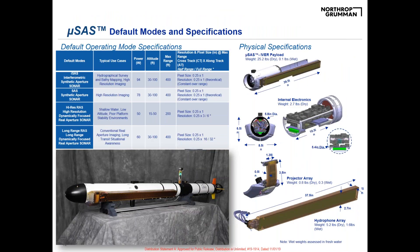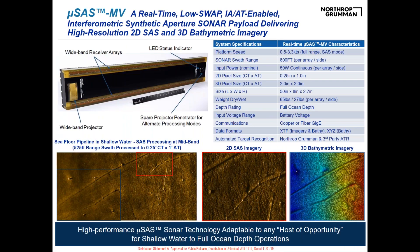From the mechanical side, what we have is a projector array and a hydrophone array — those are the main acoustic parts I specifically worked on, with the rest being electrical packaging. The follow-on sonar we were able to create, because of this rapid prototyping cycling and lessons learned from the original design, is the MicroSAS MV — medium-sized vehicle. This is a completely integrated, self-contained sonar that can go on any platform, not platform-specific, with the capability of 2D synthetic aperture sonar and 3D bathymetric imagery, all made possible by our COMSOL analysis and team.